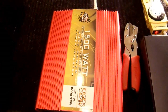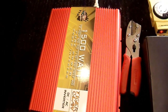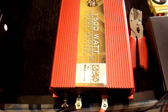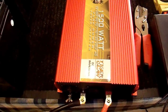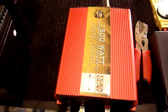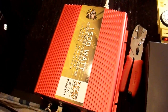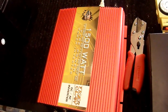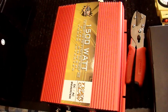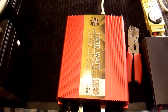I did some quick efficiency testing while this long-term load is running - it's been 10 or 15 minutes now and it seems to be doing alright. My efficiency testing, which is probably plus or minus 2 to 4 percent: at full load it was 85% efficient, that's at about 1400 watts output. If I bumped that down to 1000 watts output, it gained 1 percent, so it was 86% efficient. If I went all the way down to 300 watt output, it was about 82% efficient. So this inverter is 80 to 85% efficient, which isn't great, but it is a sine wave inverter. Your loads are a little bit more efficient - your refrigerator will take less power on this than it would on a modified sine wave inverter. So the overall system efficiency might not be too much different. But the real efficiency on this, as measured, is 80 to 85%, which is about 5% lower than some of the higher priced ones out there on the market.